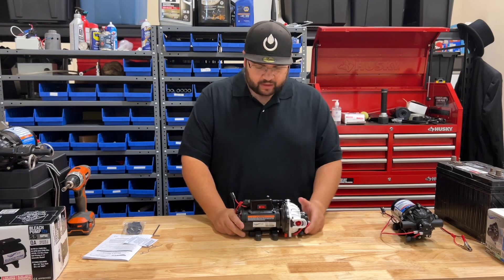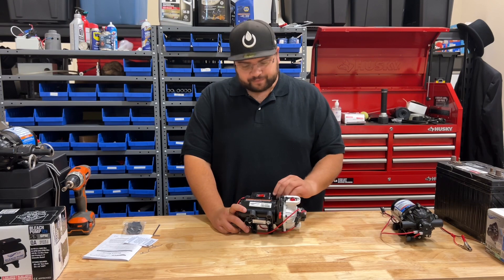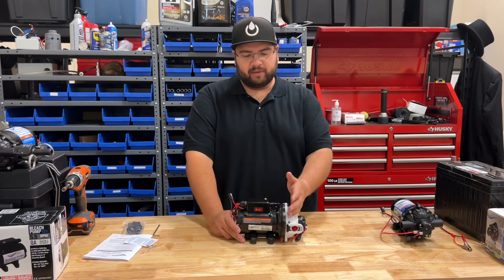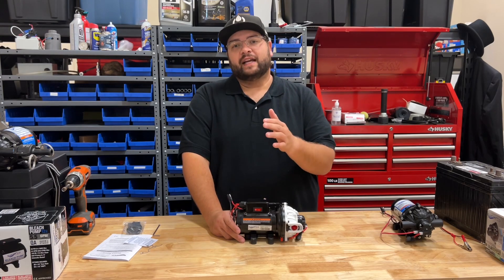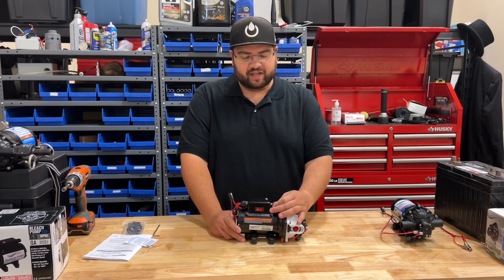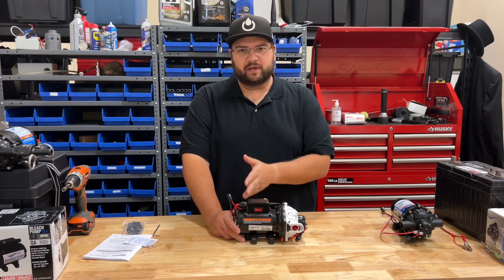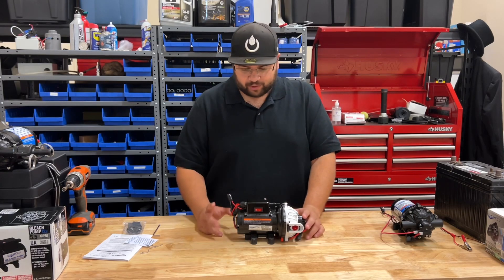You also have this guy right here — this is a leak sensor. Basically how it works: if the seals fail and it starts to leak into the pump, to preserve the body of it, it's going to automatically cut off and tell you there's a leak with that little light there. We're going to simulate that by pulling it off. I think what it does is it creates a short — the light comes on, it kills the pump, and doesn't allow you to turn it back on until you repair that leak. Pretty cool.